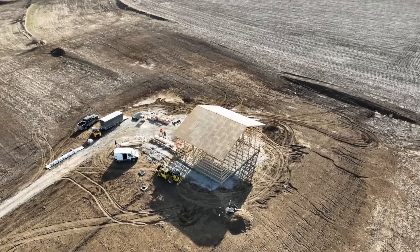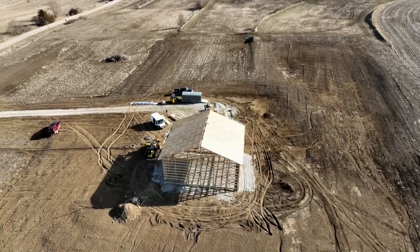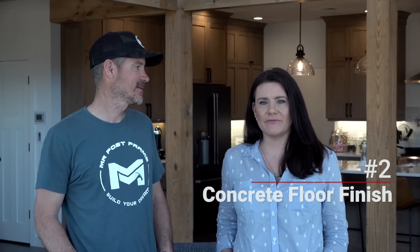With the prices of OSB now, it just makes no sense not to use it on your roof. Obviously that was one of the factors over the last couple of years why people chose not to — it was such an increase in expense — but it's not worth skipping at this point. Especially if you're DIY building, it only adds a couple thousand dollars to most projects. And if you consider using sheathing versus Drip Stop, it's really almost a wash.